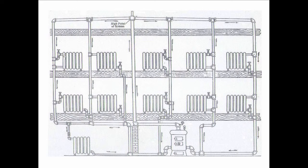it was expensive because you had two pipes to every radiator, and the pipes had to be large and they had to be the same size. So there was a lot more piping. They were limited to 180 degree water. If they went any hotter than that, it was liable to boil. So the temperature of the radiator was less, so the radiator had to be larger than the steam radiators that went in by the steam fitters. So much more expensive, but safer.